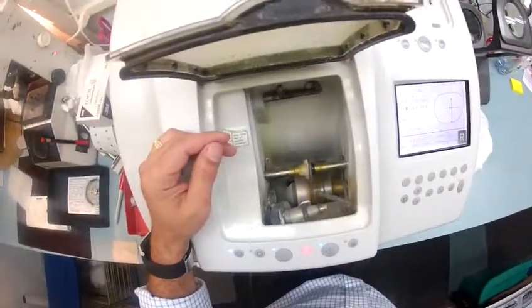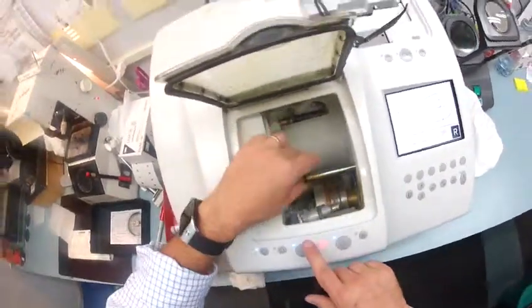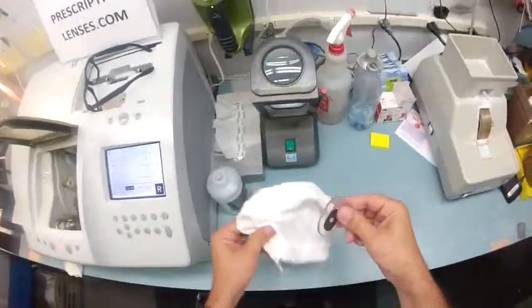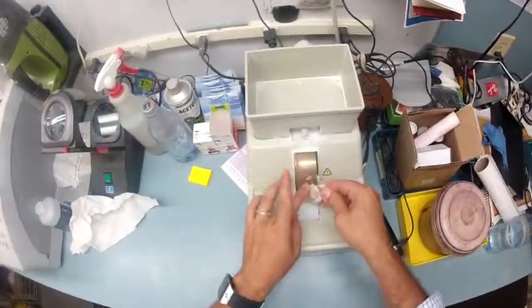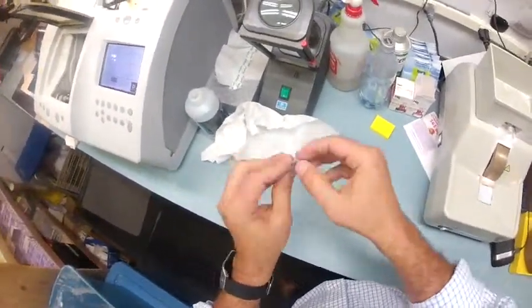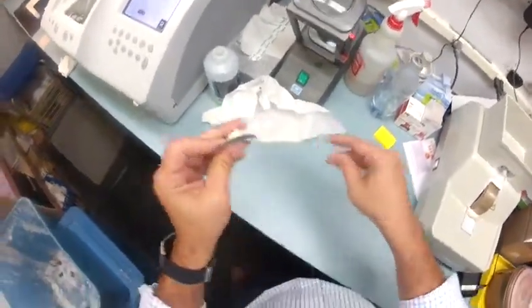Okay, just a moment, this will come out. I will pull it out of the chuck. Dry your lens off. Back to the safety bevel, back to the hand stone real quick, and then back to scraping that swarf off the edge of your lens with my occupational thumbnail. That's why I can't have pretty thumbnails. And then wipe it on the floor, you know the deal.